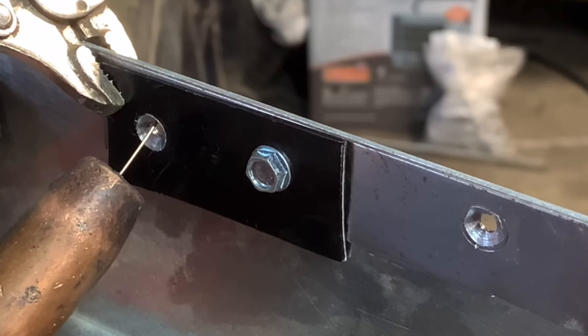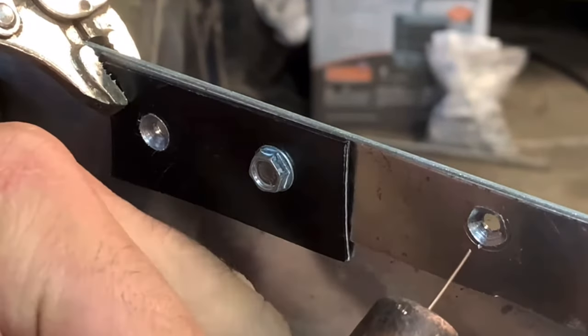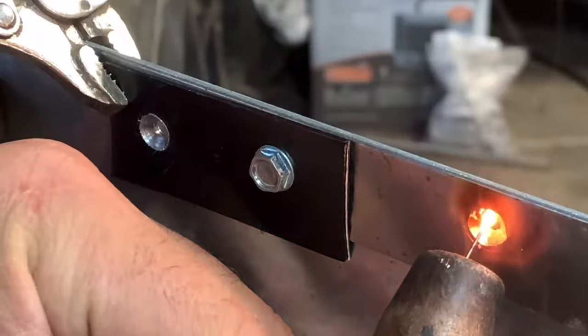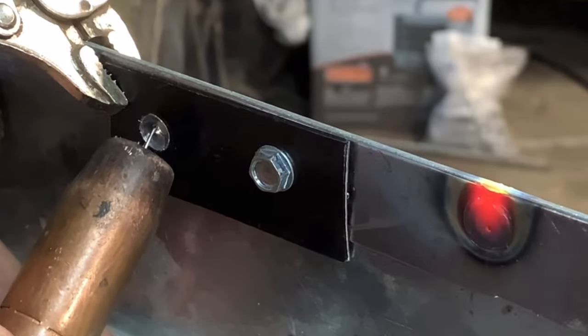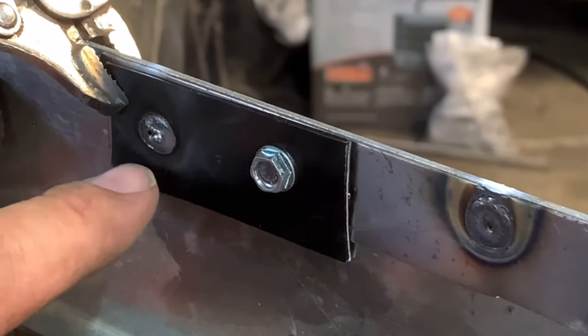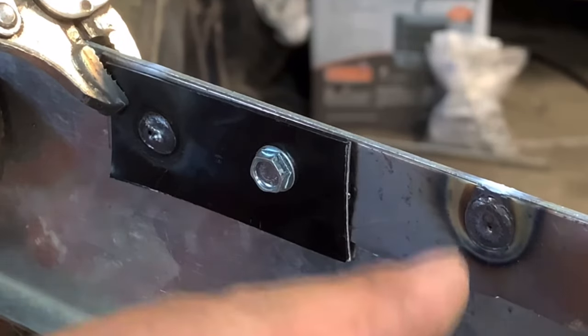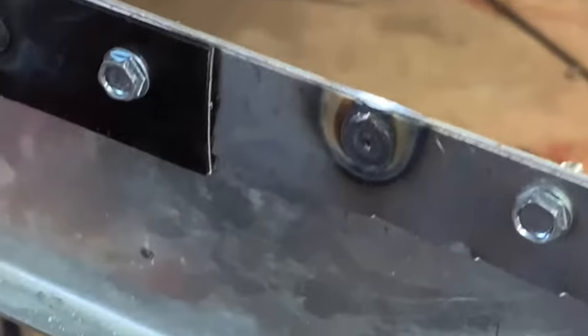Start at about the base, 12 o'clock spot, and kind of work almost like a little circle — it'll fill right in and lay out real flat. Now I'll go ahead and burn that in place so you can see it. I'll go ahead and do this one too. Now this one had a little contamination — a little bit right there — but you can see how that one laid out and it looks just like a spot weld. That's the goal here all along. So let me show you the backside — it almost looks like a spot weld too.